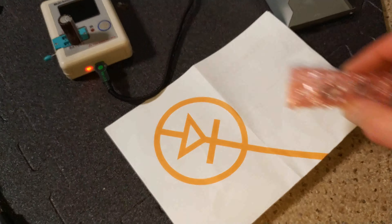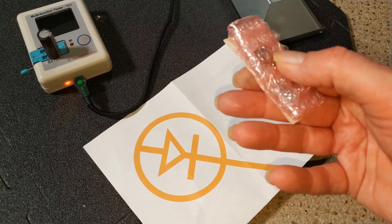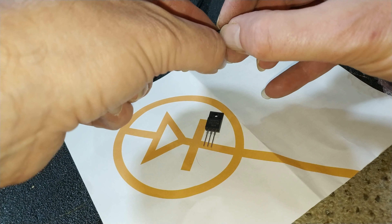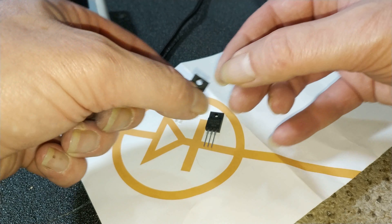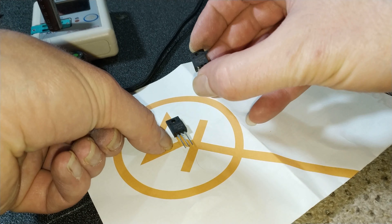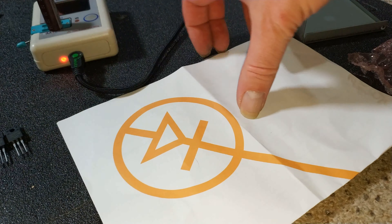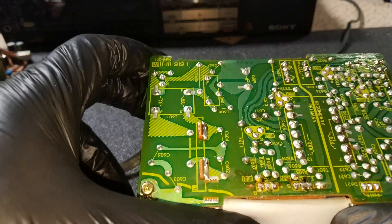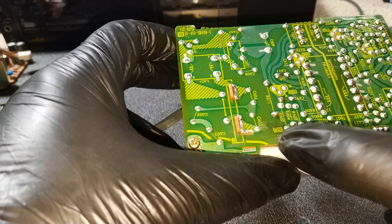So, transistors — a little diode. Same ones I bought last time. So they'll have the slightly different casing. The Sony ones are completely solid plastic right the way up, so these have a step on them for mounting. Absolutely fine — they press against the heat sink gaps that you find with these. Totally plastic encapsulated. These are apparently genuine NEC — well, we'll have to see. All done, and a pretty good solder job. I've just checked for any shorts or anything else — everything's good. I even put the meter across these just to check they're good, and they are. So let's get this back together.